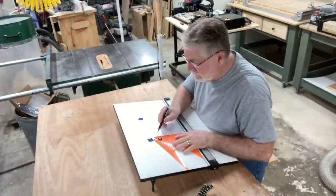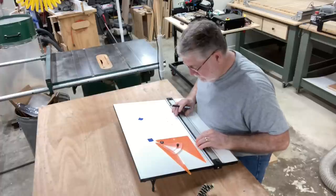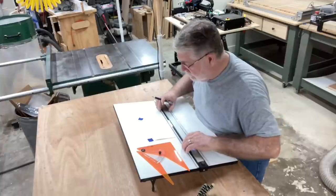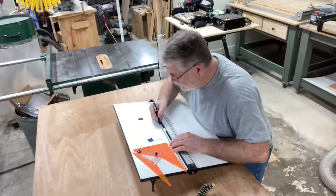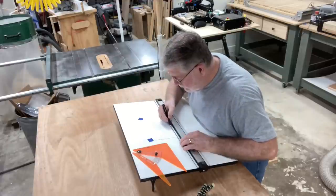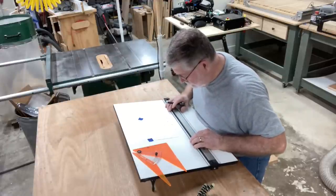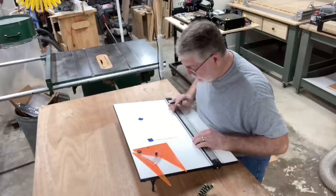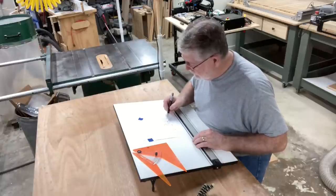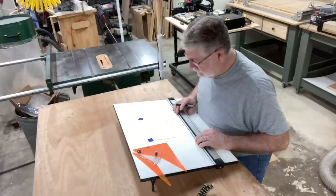To begin a project like this, I actually do the old school paper and pencil. I sketch out my ideas and test them on paper first. Once that's done, I'll take it over into a software program. This whole cabinet is all depending on the mechanism for the hinges, and that's what I'm sketching out now. This cabinet did go through many, many different revisions — even after it was under construction, I changed a lot to make this work and accomplish the goals I wanted.